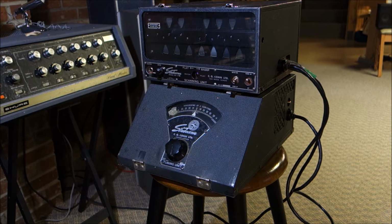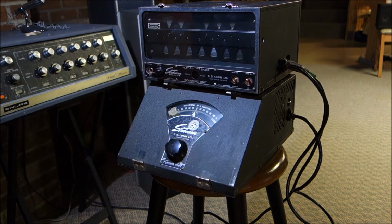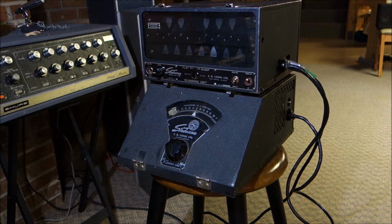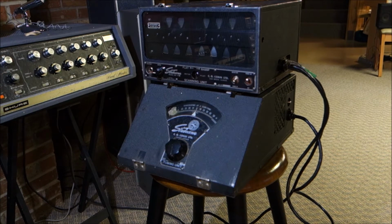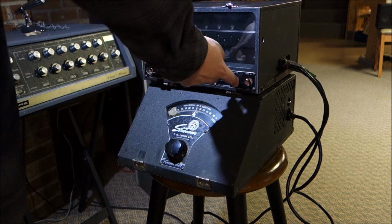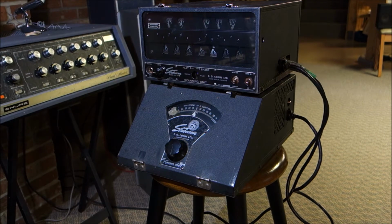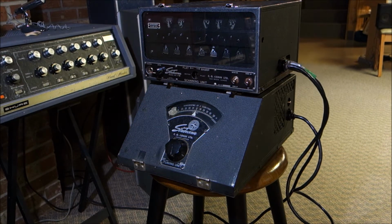Within a period of, say, 10 to 15 to 20 seconds, we should get our orange ready-to-go pilot light kicking on here, indicating that the tuning fork down below has warmed up, is oscillating, and is supplying the appropriate signal to make the motor spin at the frequency it's supposed to, with the 55 hertz tone as generated by the Stroboconn. If you don't understand what I'm talking about, it's okay. We'll deal with it. If I switch it over to motor run, it just dies because the tuning fork assembly down there is not supplying the appropriate power. So we need to get in there and see why.